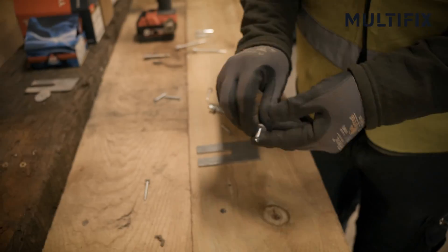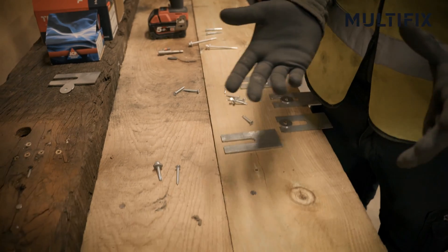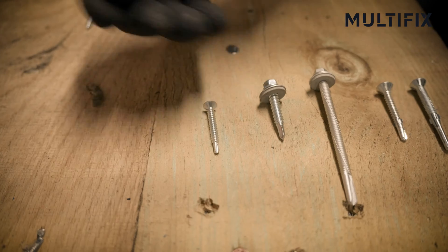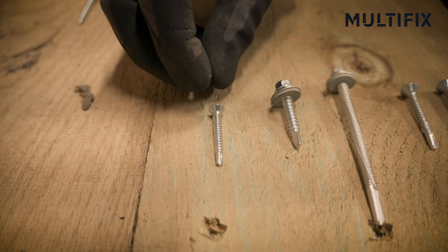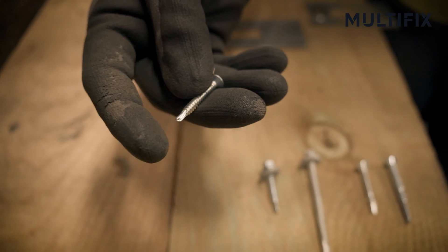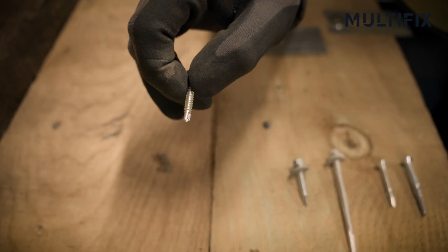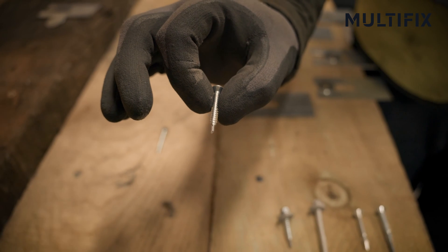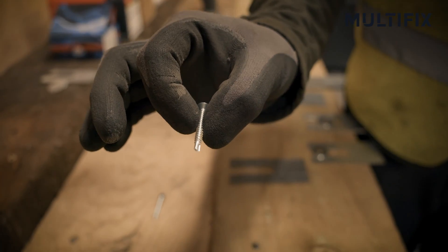We then go on into a whole range of different types, and they'll all do different types of metal, different thicknesses of metal, all for different applications. Some people just call them self-drill or self-tap. They're basically a very basic screw, built to a DIN standard but with no testing data, not classed as a structural screw — just for very light duty applications. Not really a true construction screw as such; often used for assembly line work, light fabrication, where you're not relying on the screw to provide any depth or strength of field.